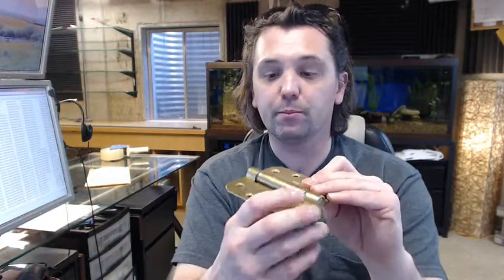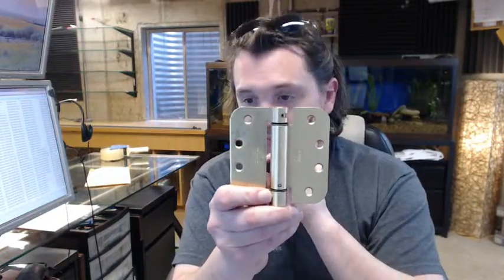Think of a tugboat pulling something. They don't go very fast, but they have a lot of torque. And I find that sort of analogy applicable to having like all 3 spring hinges, because you can set the tension such that you're not overwhelming one hinge. All 3 hinges are helping bear the job. Plus, at that very critical last few degrees of closing, there's still enough torque, so to speak, on the spring to get it to successfully overcome the latch bolt resistance and close and latch. And that's my practical experience. You can buy one and add more later if you need.